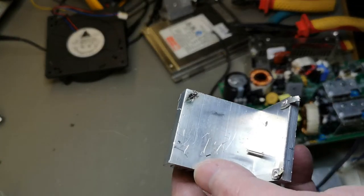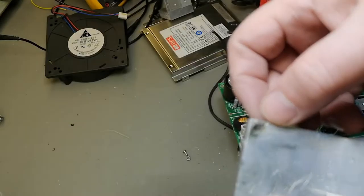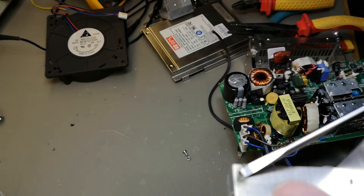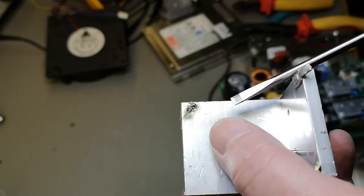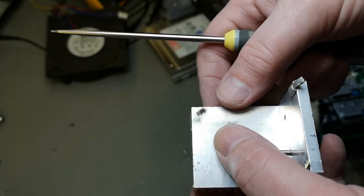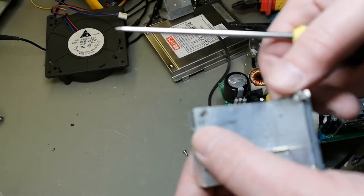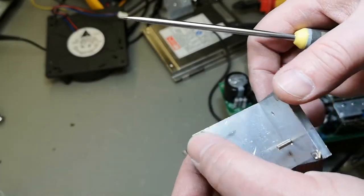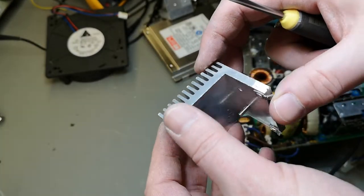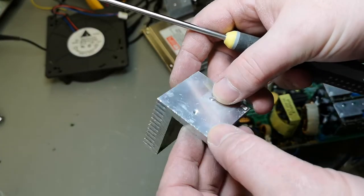Finally it was convinced to give in, and now we're in. But look — what the problem was: it actually blew a spark to the heat sink. There's a big hole — it ate a chunk of the heat sink, and because the heat sink is grounded, high currents could flow. It really ate quite a bite. But that is a nice little heat sink — just screw some stuff on and yeah.